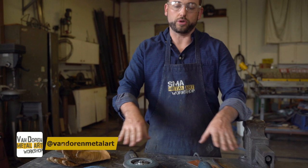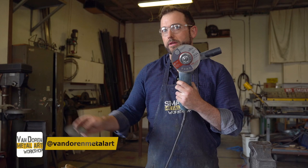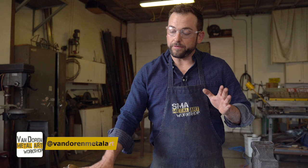The deal is there's a couple different blades that you can put on metal tools, and what happens is the blades are designed to be disposable — you throw them away when you're done. Look at how big this cut wheel is now. This is how big it is when it gets done and you can't even use it anymore. What happens is it gets smaller and smaller. This blade is made out of rock particulate, and it's made to be sharp the entire time you're using it, and then as soon as you're done, you throw it away.